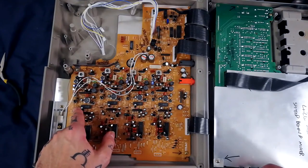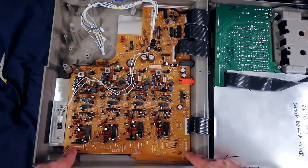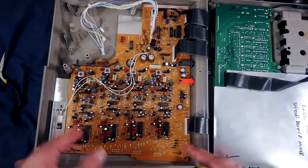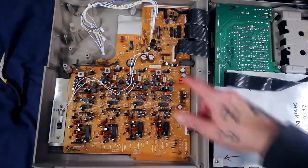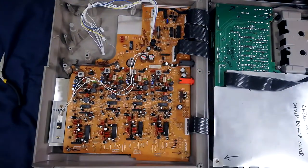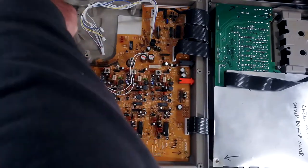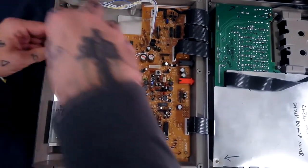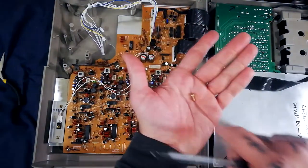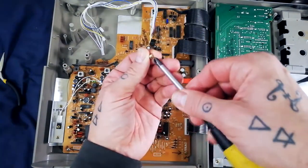Let's get this PCB — printed circuit board — separate from the plastic housing. This is something you might want to do if you needed to solder anything, maybe there's a bulging electrolytic capacitor you want to replace. There's an awkwardly shaped piece of shielding here held by two screws. All screws here, unless stated otherwise, are just over a centimeter long, wide ferrule, brass-ish appearance, crosshead Phillips type, going into plastic mounting posts.